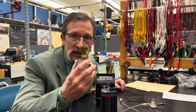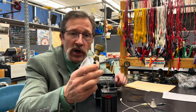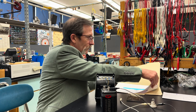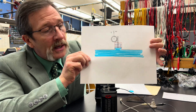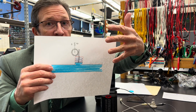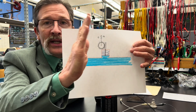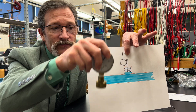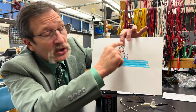Let's look at this pressure gauge diagram. You might say this analogy is nice, but our voltmeter had an in and an out — this only has an in and no outlet. We're really not going to need one, at least for the water. I've got blue for water, orange for the pipe, and a spring up here. There's a rack connected to a rod that moves up and down, and when the pinion gear rotates, it causes our dial to move back and forth. Notice the water doesn't go anywhere because it's sealed tightly on that O-ring — it never makes it to the other side.